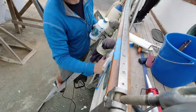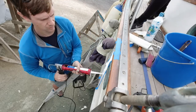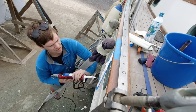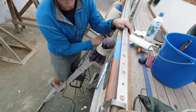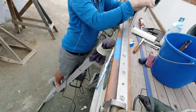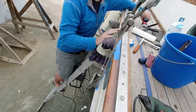While Ryan was working on the outside of the boat, I was working inside bedding the backing plates against the hull. At first we tightened the bolts just enough to squeeze up the sealant evenly, then came back when the Sikaflex was cured to give them a final tightening. It was a long job as on top of bedding the inside and outside of the six chain plates we had to unload all of the stores that were in the way.